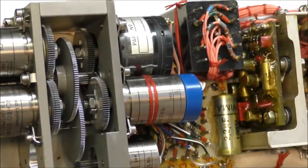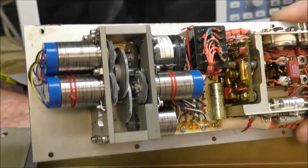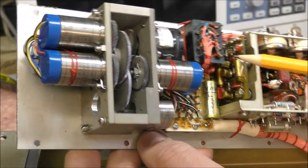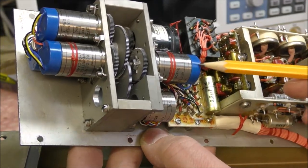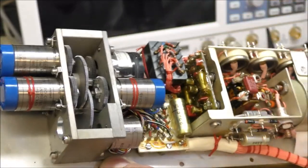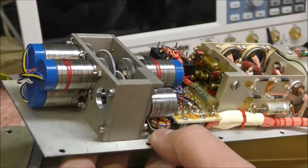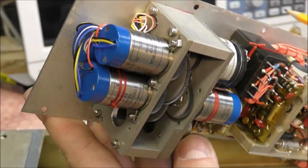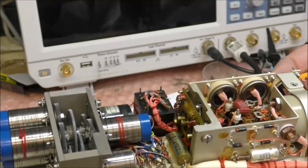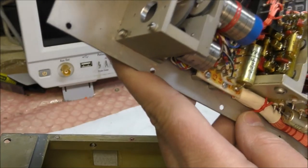This is probably used to have a duplication of the heading measurement. The input should be one synchro transformer, and all others should be connected to the rear connector in order to be connected to several passive indicators — three or four at least. It could be interesting to supply this thing; you just need to find the power supply input.